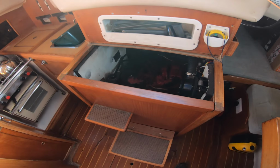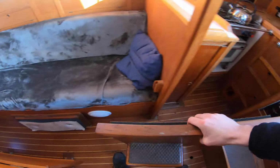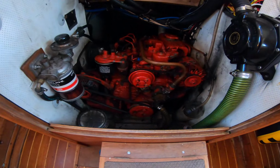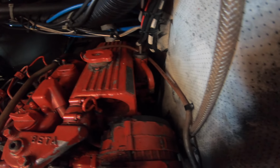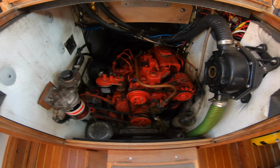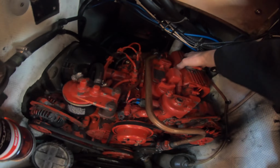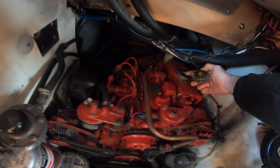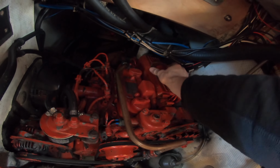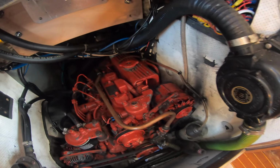So I just wanted to clarify what I was doing here. Opening up the engine hatch, when I first checked the engine out, the exhaust riser had rusted on machine screws which held it on. Because the heads were so damaged, I'd probably have to cut the heads off those to remove the riser, which would give me access to the tube stack because of the length of it. And if none of this was practical, taking the manifold off the engine and taking it to the workbench and using proper tools to locate and drill concentric would have been preferred, because you can easily damage things with a pistol drill. The other thing I was going to do before I got into anything was a block test, sucking the gases out with a block testing chemical kit to check for a head gasket failure. So it was just a question of which way around we do things and how the day unfolds. Hopefully that makes more sense than my first video.